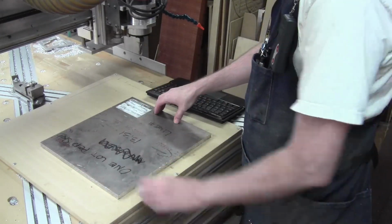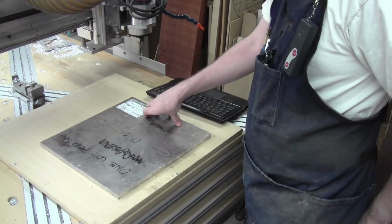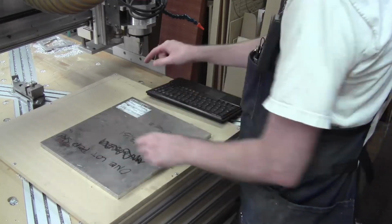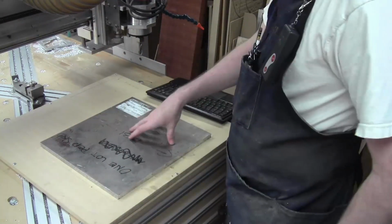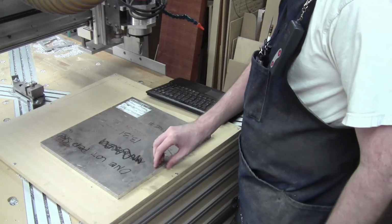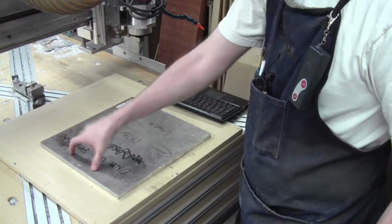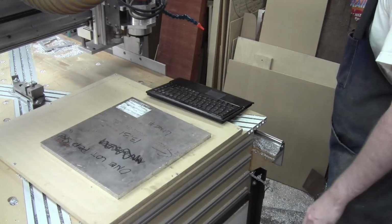There might be 6 holes if I recall. Yeah, I think there might be 6. So there's just a few pecks, no counter bores, just a few pecks. I'll drill, screw it down, and then we'll do a profile around the outside. It's kind of an obnoxious part to be doing on the CNC because it takes a while, but it's the safest way I know to get those things where I want them at the right lengths. We'll figure out a way to get that to work.